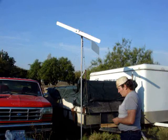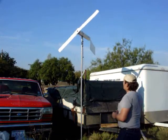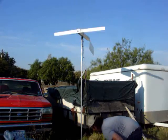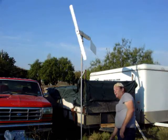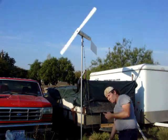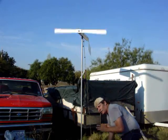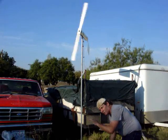Got the battery down here at 12.58 — it was at 12.42 a minute ago. I touched it to help it spin up; now it's going to speed up. Battery's still at 12.57. Now it just caught lift and took off. This is what I like — watching the prop spin up and catch that lift. Now you've got all sorts of forces that you wouldn't have had with a straight blade. This is what that Venturi curve does for you. It allows it to cut the air several times by going fast, getting the right angle of attack on the blade due to the speed of the blade and the speed of the wind.